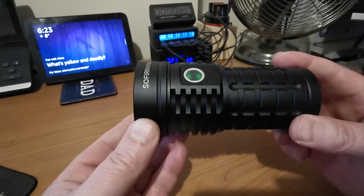Jumping back to the reference on the webpage concerning using high drain batteries. High drain batteries — in the 21700 size range — something like the Molicel 45B. This is what they call a 10C rating. C is the capacity, and with 10, you take your battery capacity — in this case 4500 — times it by 10, equals 45 amps. So if this battery is capable of providing 45 amp drain, it's classed as a 10C battery.